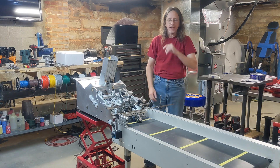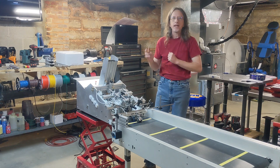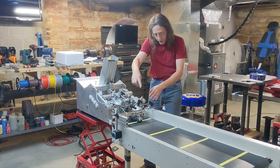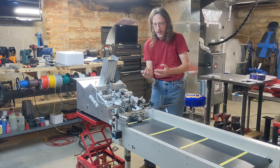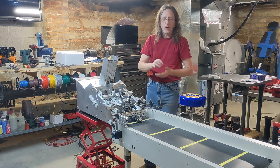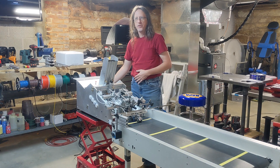Every time. Exactly. Because we're pretending like we're landing on a chained conveyor and it needs to be timed. The photo eye that triggers it is right here, and it goes under — I've got it set so that it's reading just right underneath the conveyor. There's also a delay dial hidden inside here, so that the employees can't mess with it.